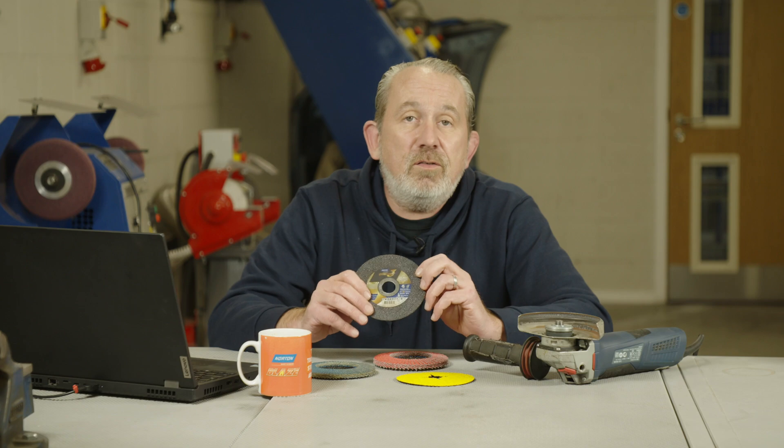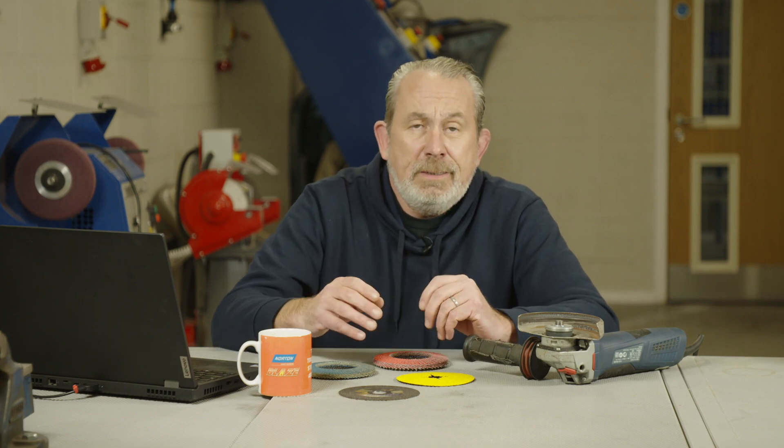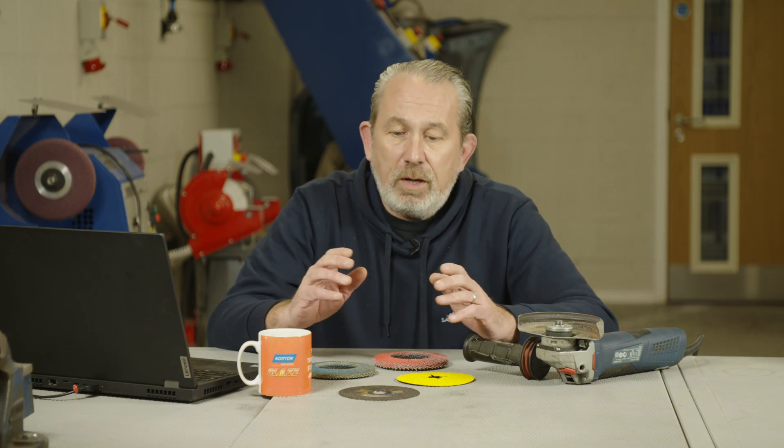If you're using a coated abrasive to take off small TIG welds on the surface, it's really simple. You need to choose a product that has a top size layer applied to the surface of the coated abrasive — here at Norton we call it a supersized layer, but it also refers to as a top size. That is a special layer put over the top of the abrasive grains which acts as a cooling agent when you grind, again reducing that heat.